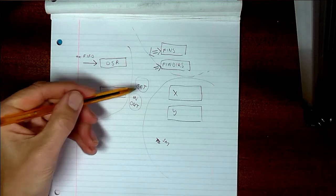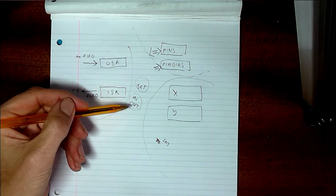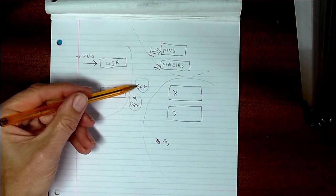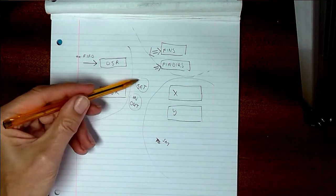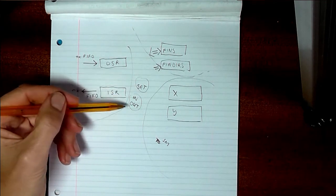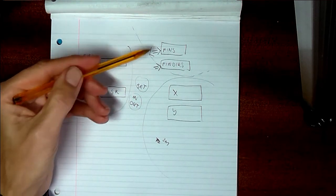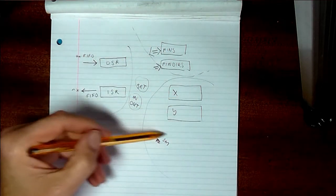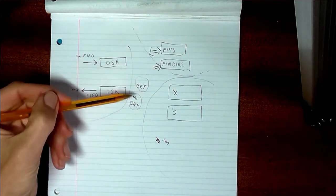Both these commands need to be enabled before you can use them. That's just like the main takeaway from this week for me. This one, I think it's called sm_config_set_set, and this one's the same, sm_config_set_out. So yeah, if you don't enable them, they're not going to do anything for you. I think that's just in relation to setting the pins with them, that they need to be enabled. You can play with them transferring information amongst the registers, but for the pins they need to be enabled.